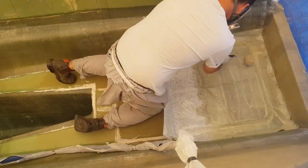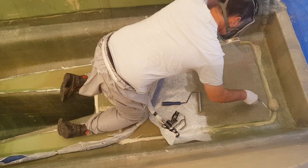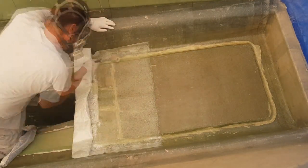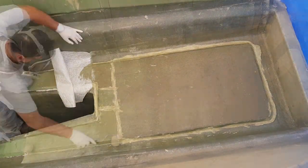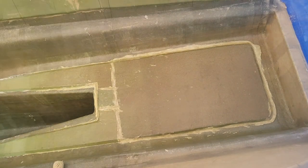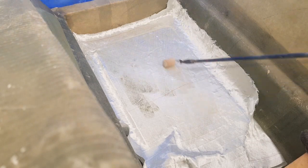I'm back on the starboard side, rear sugar scoop, where I'm just completing the foam core with the 300 CSM. It was followed up by a 600 double bias, working pretty quickly there. Cutting and tucking in all this cloth is very important to get that correct — it's a pretty precise layup. Very important that we get this right, because once I get the engine bays physically glued into place, we're going to have no access into that area.